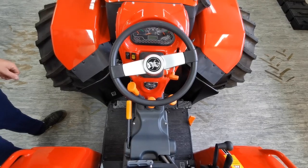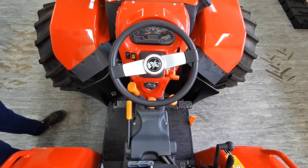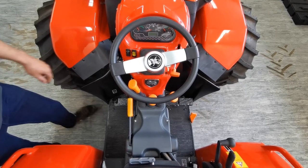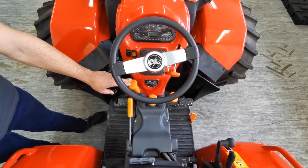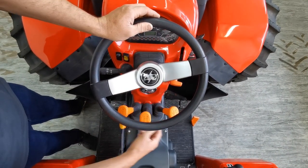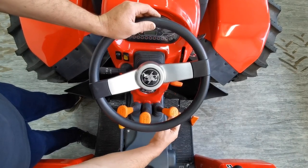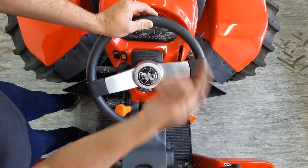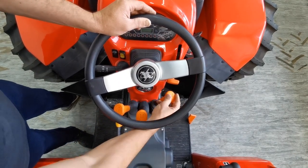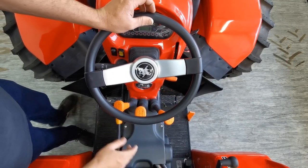I'd like to go over the operating controls of the TN 5800. Down here on your left you have your clutch pedal. Over here you have your three ranges. In the middle here you have your four synchronised gears, and on the far right you have a forward and reverse synchro shuttle, which you can leave all these gears and ranges in and just simply push the clutch in, go forward and reverse without having to touch these controls.